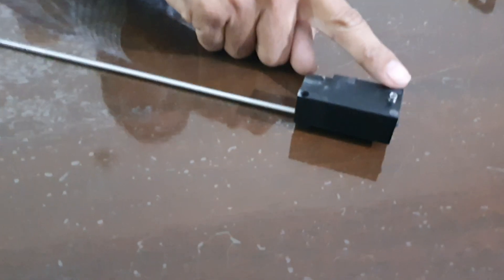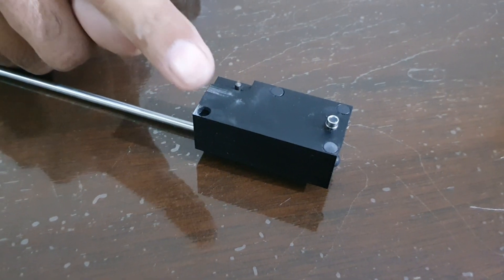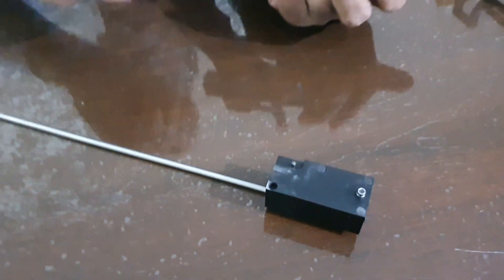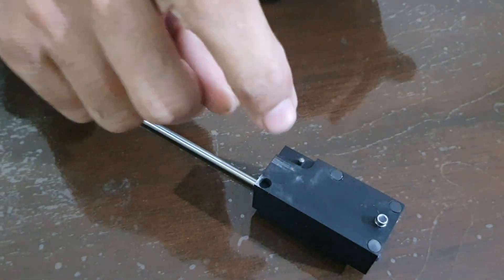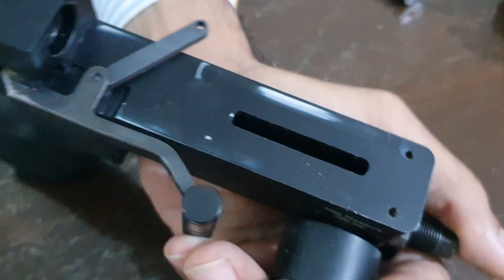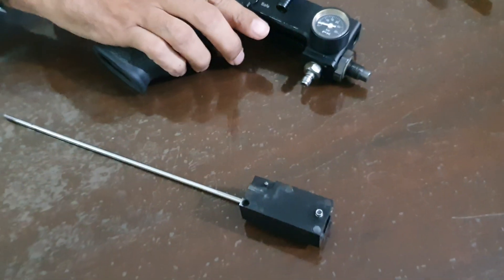Just see — here should be four delrin pads, but this delrin pad is missing. Someone who opened it missed it. What is the result? These delrin pads help with the sliding movement of this part onto this part. When this was misplaced, there was direct contact of this area with this area — you can see the color has gone, you can see the color of the metal, aluminum alloy. Just because someone lost this part, this is the issue.